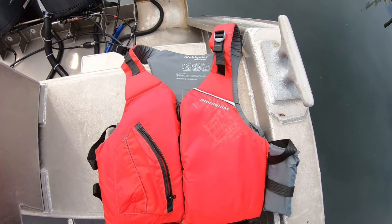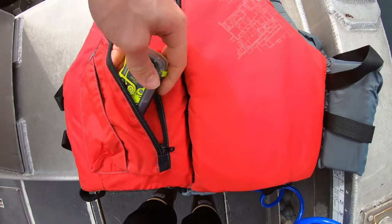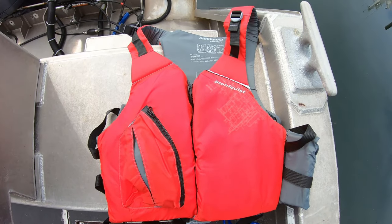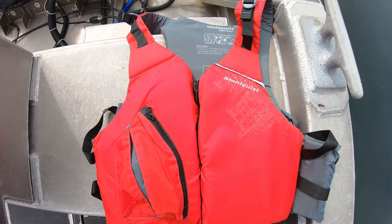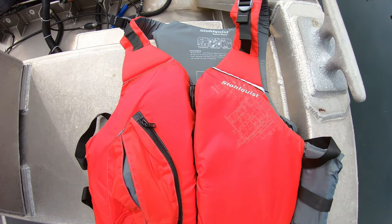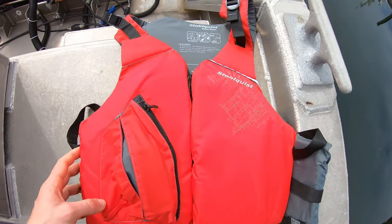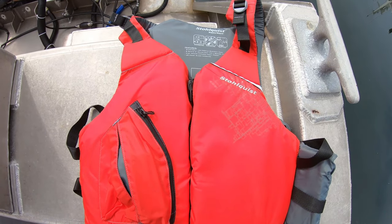Here's a great example of a life jacket that's perfect for holding a PLB because it has a zipper pouch — just put your PLB right in there, close it up, and forget you have it. Even if you don't wear your life jacket all the time on the ocean, it's still great to have it onboard with a PLB inside. Keep it in an open area — up on your dash or laying on a seat — so if your boat has a problem, it will float away and be quickly accessible. Don't have it tucked somewhere you can't reach.